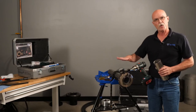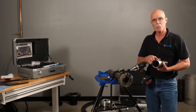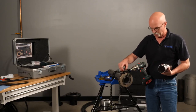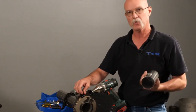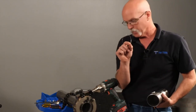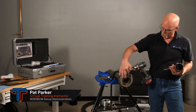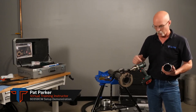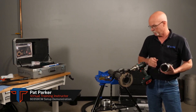At the end you'll notice I was skip feeding — if you're on stainless or similar hard material, you want to skip feed at the end so the bit doesn't bite as it's cutting through the pipe. Then I made a couple more rotations after the long piece was removed to get rid of the burr ring. As mentioned earlier, you can run just a single tool bit or tool block and remove the other one — no sense in wearing it out when you're on a thin wall schedule pipe or tube.